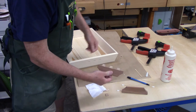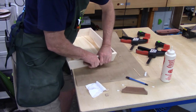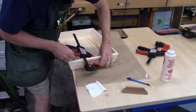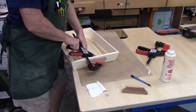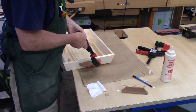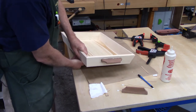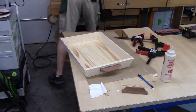Orientation is important — make sure your bottom side is toward the bottom and your top side is toward the top. It's nice to have the clamps handy to pull this thing together. As you notice, there's plenty of glue squeeze out even with that small amount of glue. The dominoes hold it fairly tightly anyway, so that shouldn't be a problem. I had plenty of squeeze out on both the top and the bottom. I'm going to let that skim over, then use this carbide scraper to scrape off the excess.